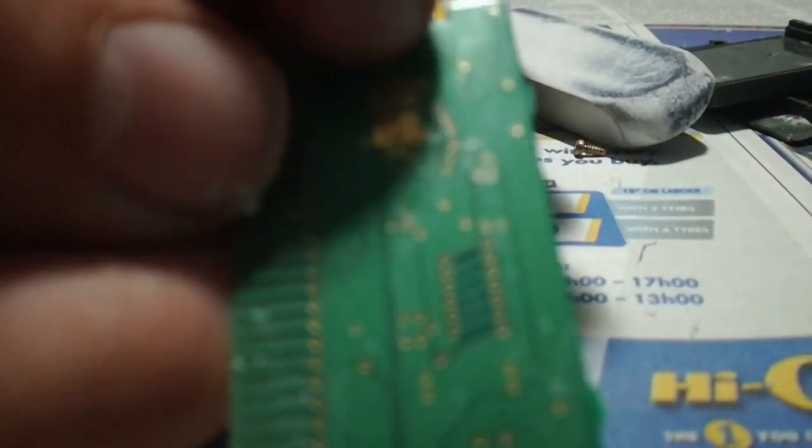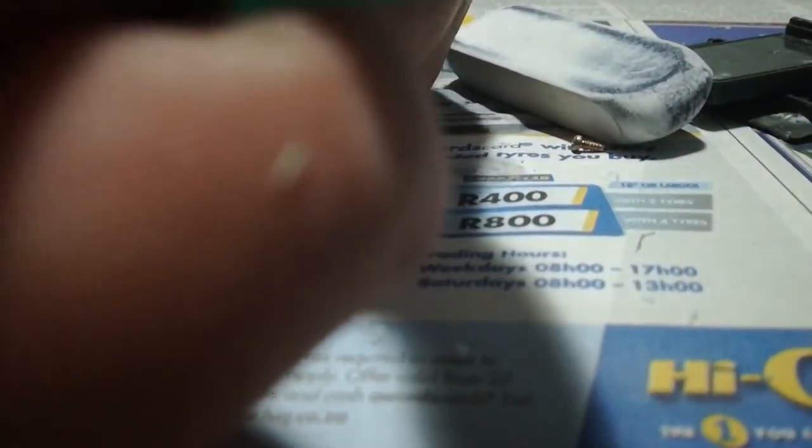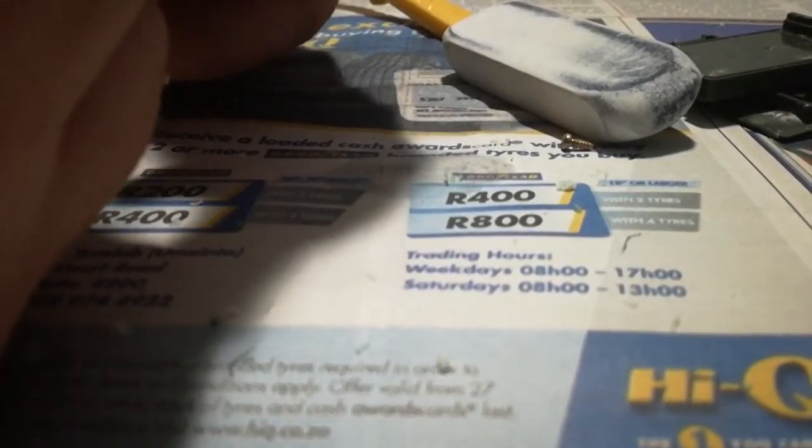Basically, as far as I know, all you have to do is make sure that all these separate gold pieces aren't touching by any means. This waxy residue must not create a short circuit at all. The green part of the board is just plastic — it's not really going to do much. You just go over it with your thumb, kind of gently but a bit aggressively, and you want to make sure you're getting that excess residue off, because if it's on there that's not helping you.